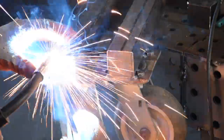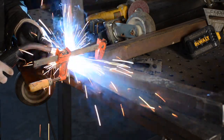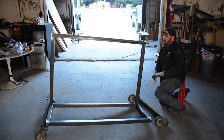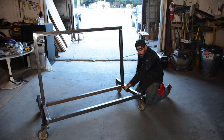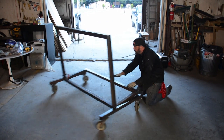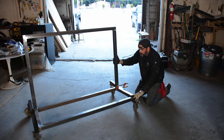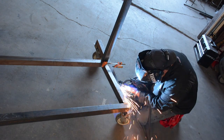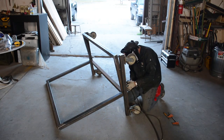I'm capping those holes just for style. I cut a quarter-inch piece of steel, sanded and ground it so it would fit right inside, and put a little taper on it so when I bang them in they get snugged up. Now I'm taking that rack and tilting it back ten degrees. I wasn't going to try and guess that all four wheels were going to touch the ground perfectly — I welded one side, then on level ground I make sure all wheels ride the ground. They do, so I'm set, and now I weld the second side in place to assure all four wheels will touch.